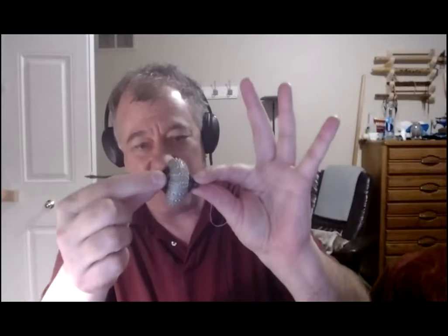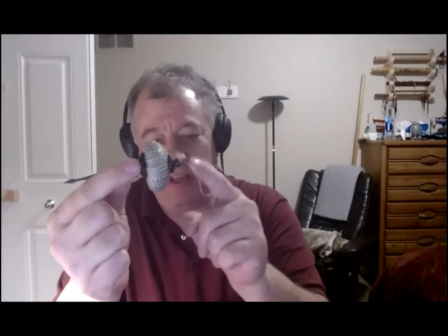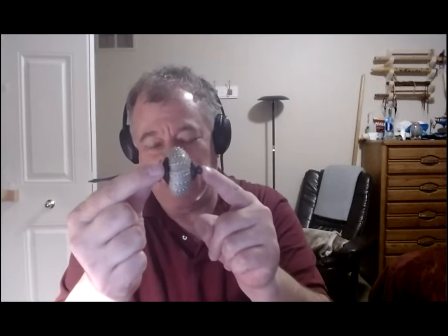I have a question for Matt. Yes, sir. How do you fasten the top and bottom finials on there? Do you run a rod all the way through? Yeah, there is an 1/8-inch dowel between the two. So when I'm turning them, there's an 1/8-inch cavity in the bottom icicle for the dowel to sit in. And then there's an 1/8-inch hole all the way through the top finial. And that's how you get the fishing line in it: you put that in and then you stick the dowel in and glue it in and then you stain it all.